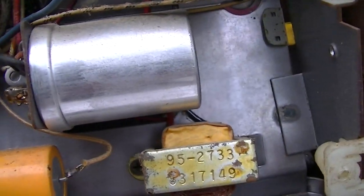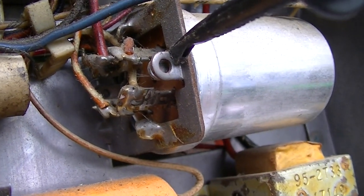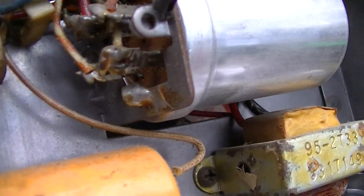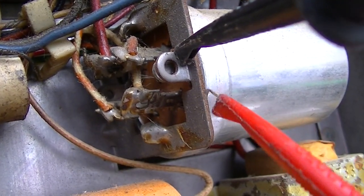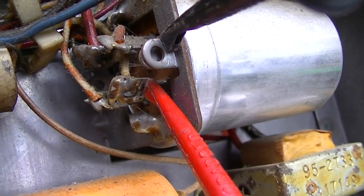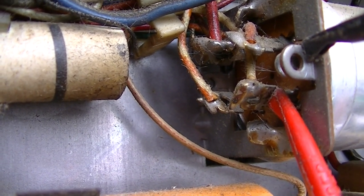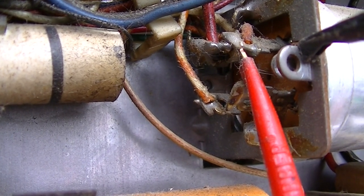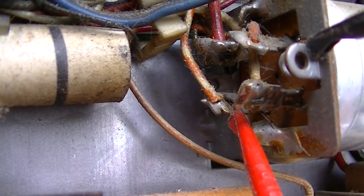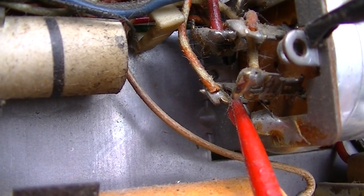All right, let's quickly do this multi-section electrolytic here. So let's start bypassed. Let's crank it up. Try to get the maximum punch we can. All right, multi-section electrolytic. All right, that section sounds low microfarad, but not low ESR. It's a little bit higher microfarad. That section there is dead. Nobody home.